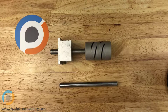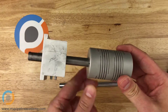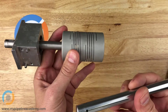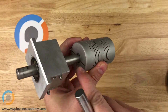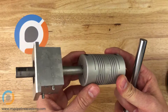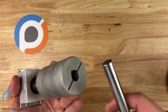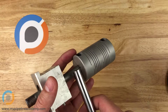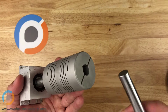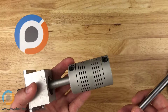Let's look at a flexible shaft coupler. This is a flexible shaft coupler — it couples one shaft to another. This particular one has the same bore diameter on both sides, meaning it couples two shafts of the same diameter, but they're available in a wide variety of different sizes. For example, we have half inch here and half inch here, but you might find something that's half inch here and three-eighths inch there, or a quarter inch here and five-eighths of an inch there. So you can couple different shaft diameters together.